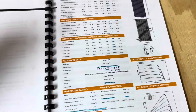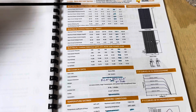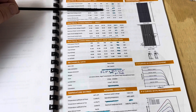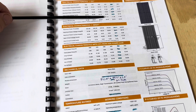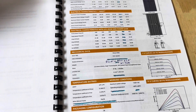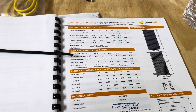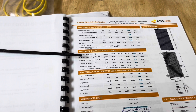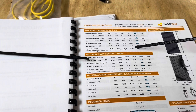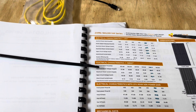I'm using the 445-watt units - I highlighted the 450 but that was a mistake. The maximum power current is 10.6 amps and the maximum short circuit current is 11.5 amps. I have two strings in parallel, so this 11.5 combines with the second string, giving a total short circuit current of 23 amps. So if my panels or wiring shorts anywhere on source circuit one from the array all the way back to my inverters, the maximum current should be twice 11.5, which is 23 amps.